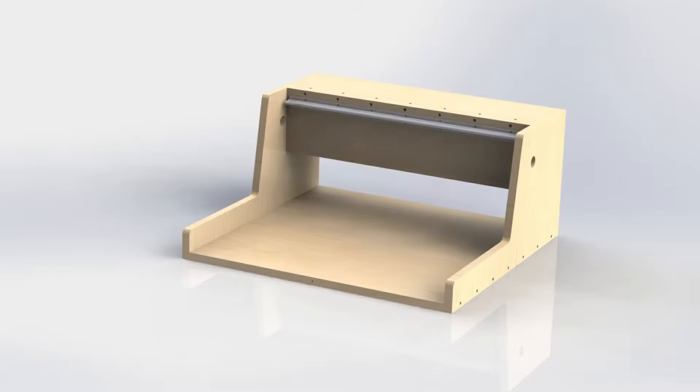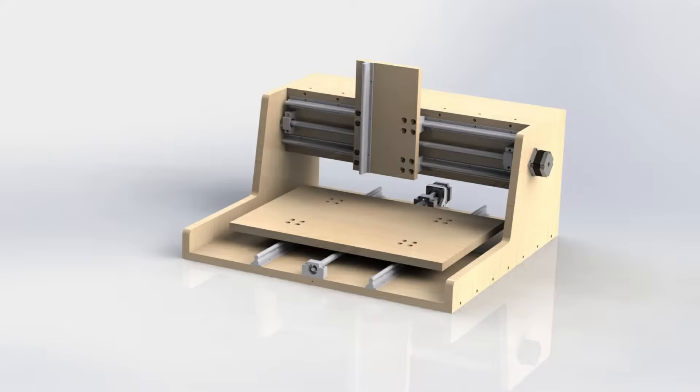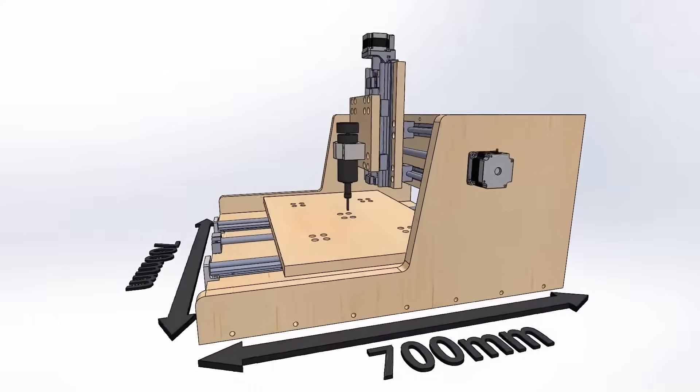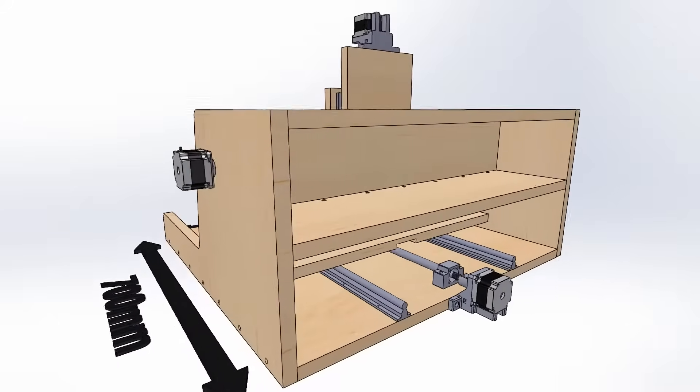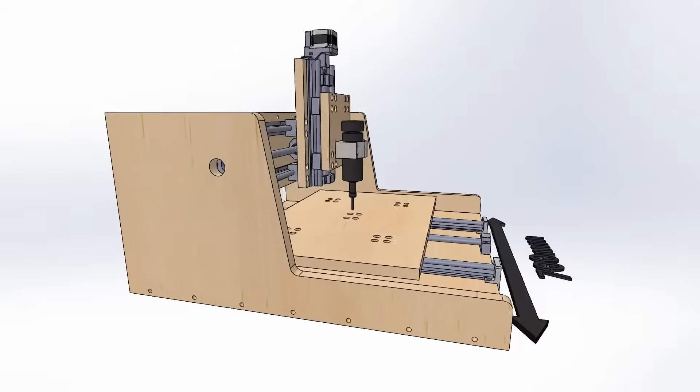In this video I'm going to show you how I built this cheap and simple yet sturdy CNC machine. To achieve greater rigidity I wanted to try a portal CNC machine design where two columns support a non-moving cross beam. As a bonus, all the electronics will take place inside this cross beam, so the machine will be compact.